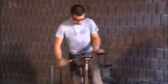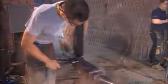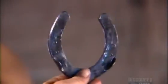Horses first wear shoes at about 3 years old, the age when they start working or competing. The farrier fine-tunes the fitting with a metal filing tool, curving the edges further to make them even safer for the horse. Next, he shines the steel with a metal brush. The shine will quickly fade once the horse takes its first steps. Depending on the foot size, the finished shoe can measure anywhere from 7 to 25 centimeters across.